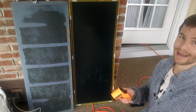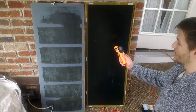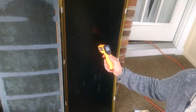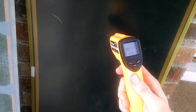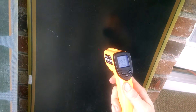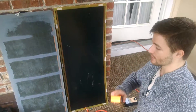Big difference between that and ceramic. That's pretty much it for this video. I just wanted to illustrate the principle that no matter where you set the thermostat, no matter what they claim, if there's a carbon panel in there, you're pretty much going to blow past 100 degrees and start to have a peak wavelength that's definitely much lower than 9.4 microns. Thanks for watching.